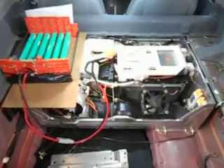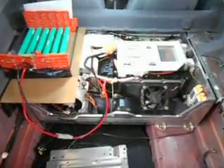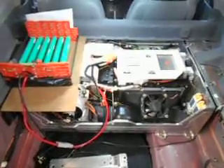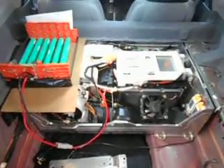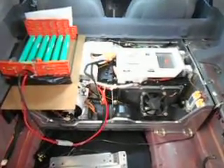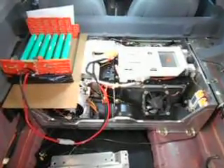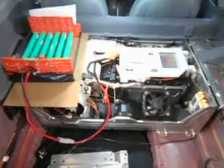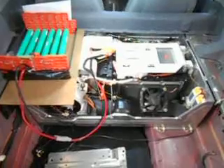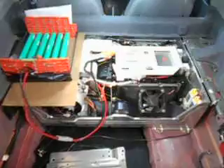The IGBT is squealing a bit but it hasn't triggered the short circuit current flag, which it could do if the current goes over the maximum the IGBT will allow — so that's a good sign, because we're not trying to push the current higher, we're pushing the voltage higher. I might try eight sticks and possibly ten, though I'll have to feel brave before going to ten. So that's where we are — it's working without the DC-to-DC converter in circuit, interesting learning quite a bit.